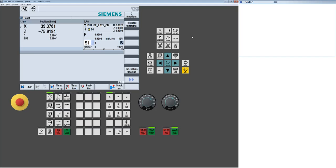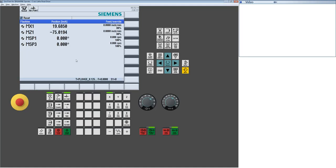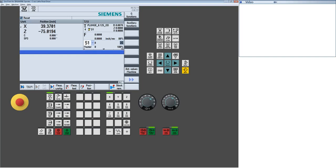The first function we're going to talk about is the TSM field. Right now we're in the jog screen — I know that because in the upper left-hand corner, I'm in machine mode and my jog screen light is up. This is typically the first screen you see whenever you power up the machine tool, possibly after a reference point or homing process. The jog screen was created to allow you to start moving around the machine and setting offsets, keeping things simple for operators with visually graphical screens that guide you through setup.